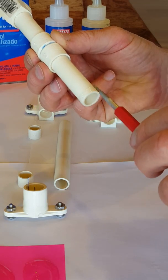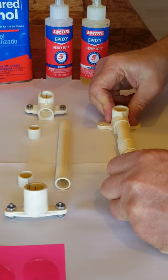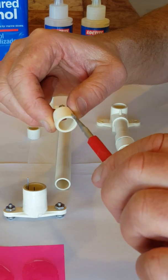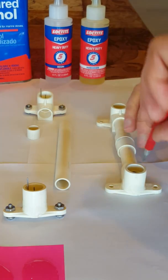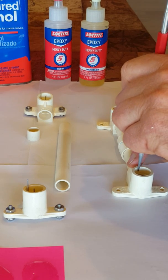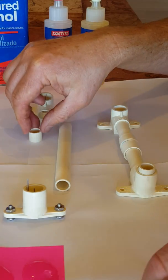The working time of this epoxy is five minutes, so I don't have a whole lot of time to make mistakes, so I'm going rather rapidly, forcing that bottom piece together. Now I'm going to install these little risers and the midsection. These are actually cut down about a quarter of an inch so that the rise is less. Put those down until they're seated nicely.